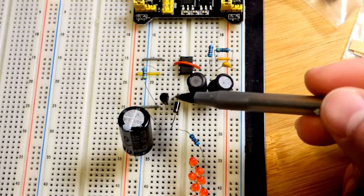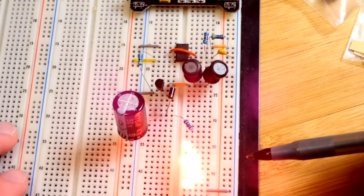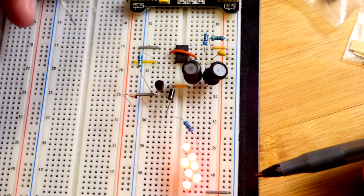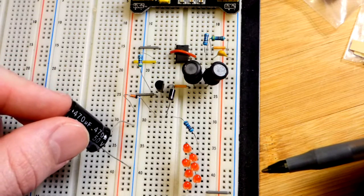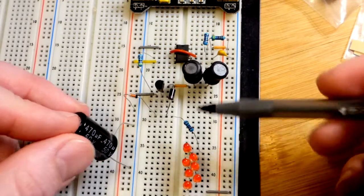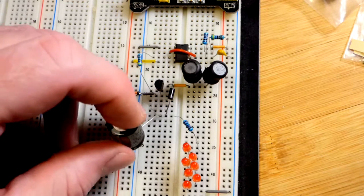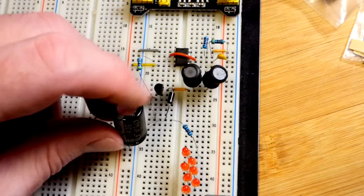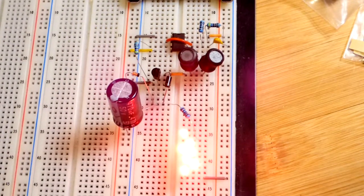Because of the internal resistance I think the current is limited to below 500 milliamps. Now we're going to turn this on and pluck the capacitor out — the capacitor is not completely needed. We'll turn the power supply off. A lot of times I short circuit capacitors to discharge them, but you do not want to do that with this one. You saw that spark — probably better to discharge this capacitor after it's charged using a resistor. It will probably go down over time, but in any case it does go back in.